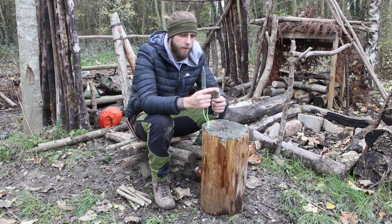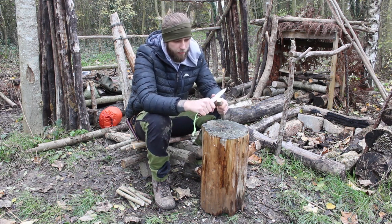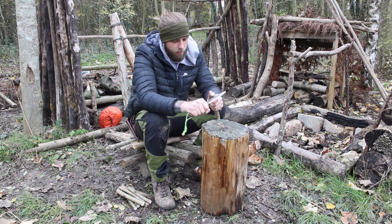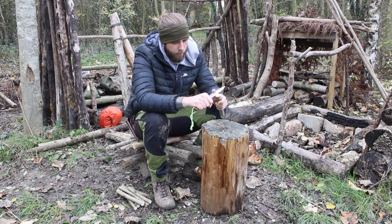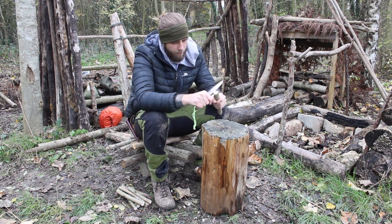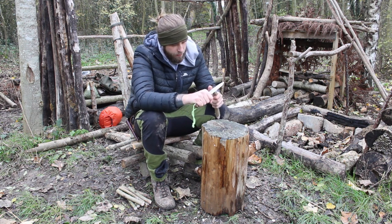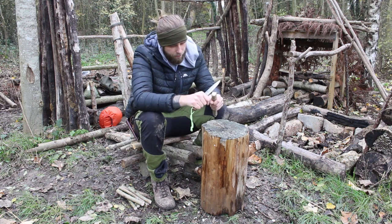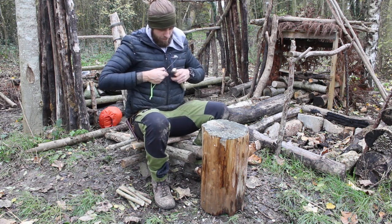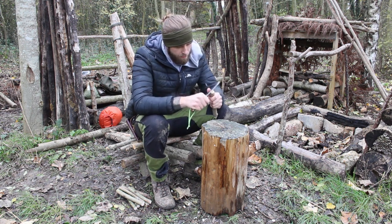I think that should be absolutely fine. All I'm going to do now is taper the tip a little bit, just to put a secondary bevel on it, to make sure that it stays in the ground and it doesn't mushroom out when we knock it into the ground. The cut that I'm using is to use my left thumb to apply pressure to the back of the blade — it's nice and controlled, really good for intricate work.